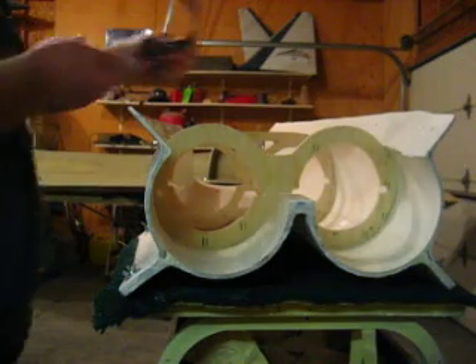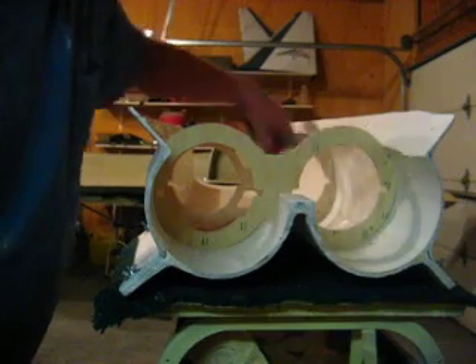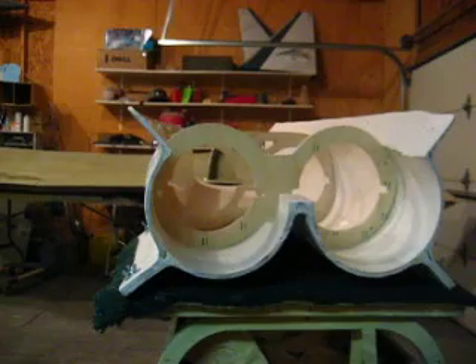This is a motor mount for a 30-pound turbine, and I had to make sure that'll fit. I've got my motor mount rails on there. That's about what I've got going today, but I wanted to give everyone a heads up on how I was going to lay them up. I'll lay these pieces up individually, let it set up for about four hours — about halfway through the cure — then trim that edge, because it trims really easy when that epoxy just starts to go off and it's a little rubbery. I'll bolt my pieces up, put that tape on there, then put the front on before I put the top on. I'll go all the way around this edge, take some spray contact cement, and spray this piece of tape up in that nose before I put the top on, so I won't have to fish that piece in there.